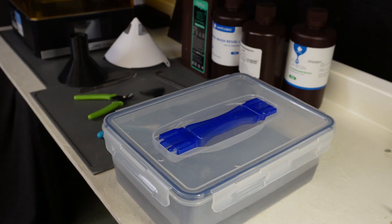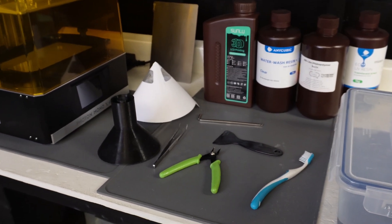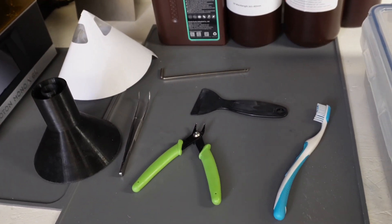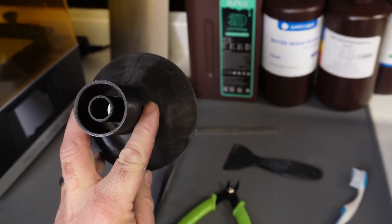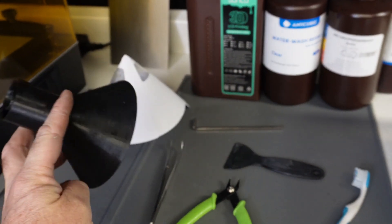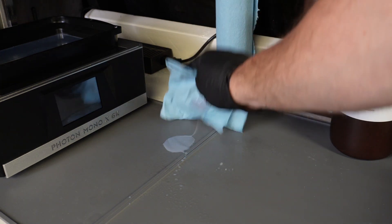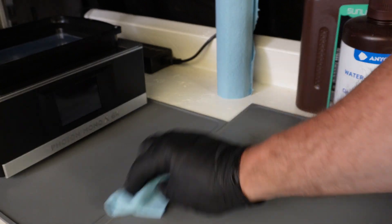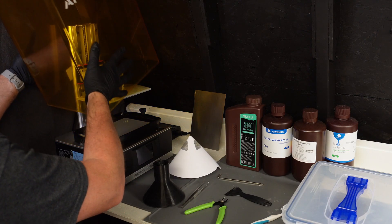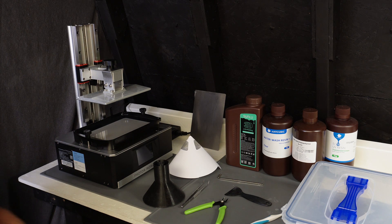If you're new, here's a basic setup: a tub of alcohol, a toothbrush, the clippers and spatula that come with the machine, and a pair of tweezers really helps. I'll put a link below to a funnel file I printed on my FDM printer for putting your resin back in your bottles. Here's a quick demo of the silicone mats — super easy to clean up. Just spray with a little alcohol and wipe it off; you can see the alcohol dissolves the resin off the mat.